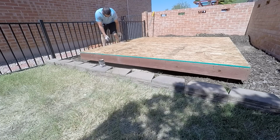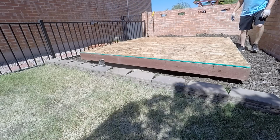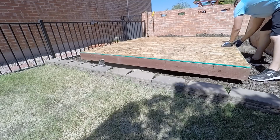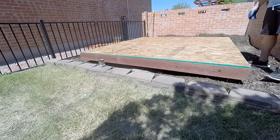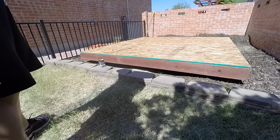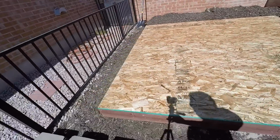It's a lot different than when purchasing lumber, that when they say it's 2x4x8, which is 96 inches, they actually show you on the bottom the actual size, which could be 96.5 inches. It could be 95.25 inches. Whatever they sell it at, they will show you the actual size, so you're not actually buying the full length of an 8-footer. And with plywood, it's a little different. They actually sell it at the length that they advertise.